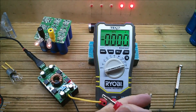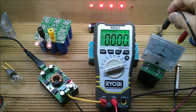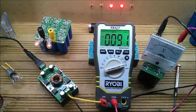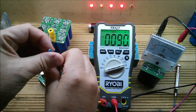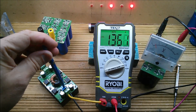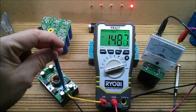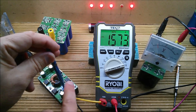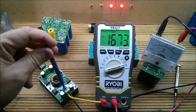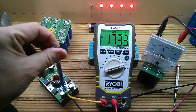I'm keen to switch to this supercapacitor module because it has a voltmeter, so we can see the voltage. Will it get across when I put this heavy load across it? About 90 milliamps — that seems alright. Let's raise the current. We've got an amp, and we'll watch the voltage on this come up — it's about two and a half volts. But that current is climbing quite quickly without me turning anything. So constant current it ain't — it will be constant if you have a constant voltage load, but not a rising-voltage load like a capacitor.